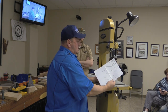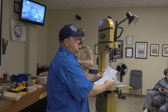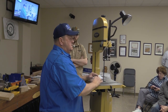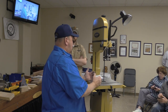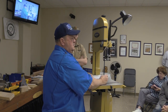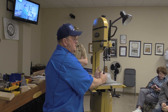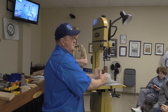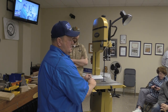I found this chart really easy to find, because it's one thing I wanted to tell people about. If you're trying to make a smaller radius than what the blade is rated for, you're straining the blade. If you're making a turn, and not just cutting flat wood, you can hear it hitting the bearings hard or something like that. You're damaging a lot of different things. And one thing you don't think about: when you're hearing those bearings run all the time, if you don't have it adjusted, that bearing heats up, and it heats up the blade. The metal itself is heat treated when you get it, so if you heat up the metal on the blade because of the bearings, you're messing up the bearings and you're messing up your blades. So you don't want to be forcing it where you're hearing that roar the whole time, because you know you're doing something rash.